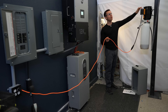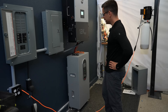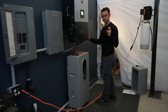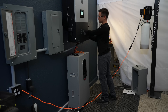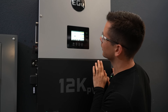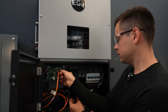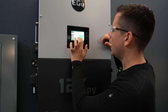The battery is going to die so I'm going to disconnect the Tesla, charge the battery back up, and connect the grid — it's actually the 18K PV on the other side of the workshop. I think we need to change settings so it will charge. I forgot to add the CTs — I'm such an idiot. Oh, they're labeled now, that's nice. Connect the grid and let's set up a charging schedule.